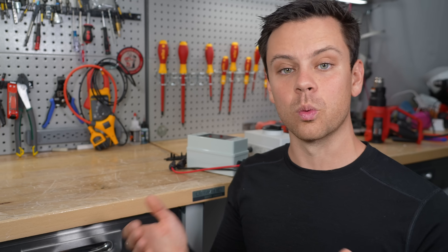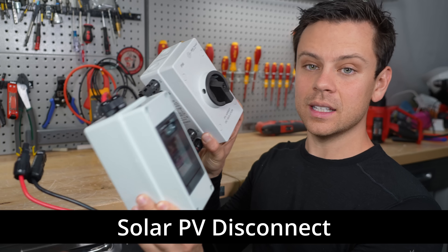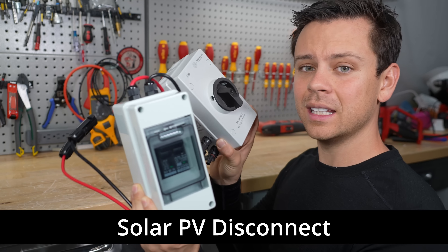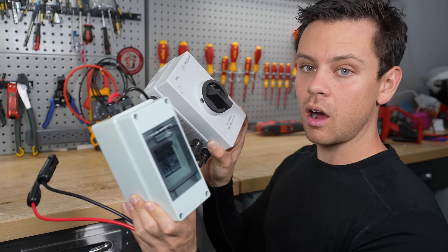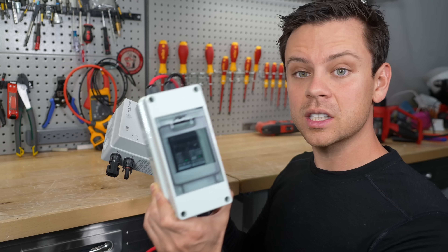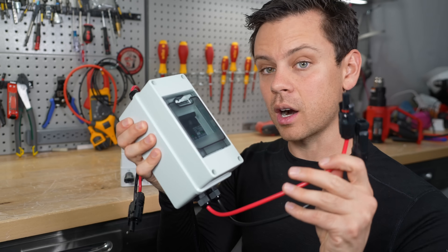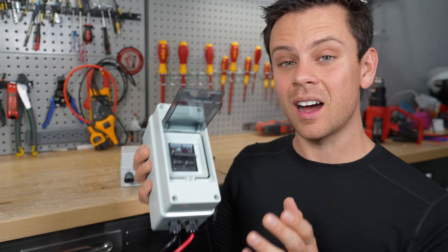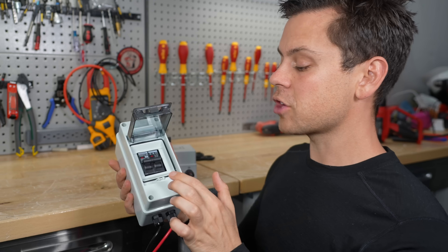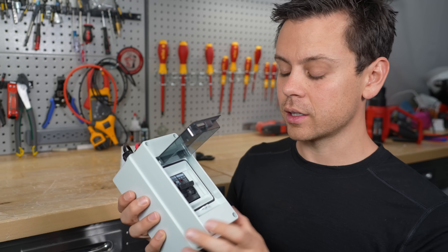You have to be very careful when working with solar panels, but if you know what you're doing, you'll never get shocked. These are called PV disconnects. Whether your inverter has one built in or not, I highly recommend buying one and putting it in line with your system. It's a switch to turn off power coming from the solar panels, and they come in every size — this one's for larger systems, but you can also use them for small systems, even like a small EcoFlow. You connect your solar panels on one side and your EcoFlow on the other. Inside there's a circuit breaker, but this is not a typical circuit breaker — it's rated for high voltage and can extinguish a large DC arc. Don't use a marine or house circuit breaker; you have to use this type with a solar string.